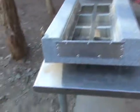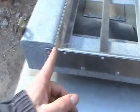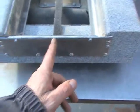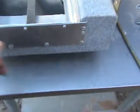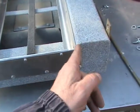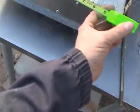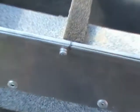is a pain in the ass, as Mobile Tech mentioned. So, okay, we have disassembled. Want to measure the gap centered. We do not want to measure it from here to here because that aluminum plate is not centered. So here to here, 4 3/8, 4 3/8. The mark is right there.